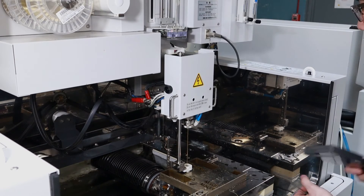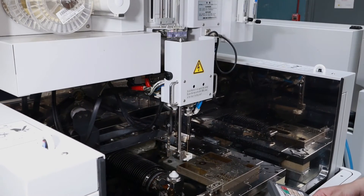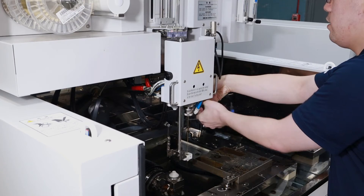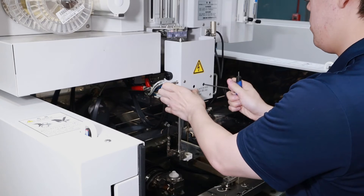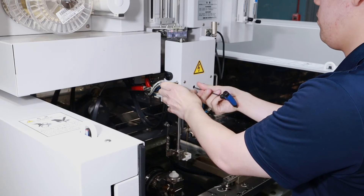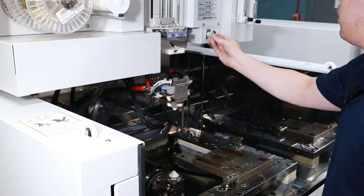Now that we're finished, we will take off the SHM. What I do is raise the upper head and move it out of the way so that I don't damage anything. Then all it requires is to unplug the electrical, disconnect the flushing, and connect that back into the upper head. Take our 3mm Allen wrench, loosen the screws, and take off the machine. Cap back on.